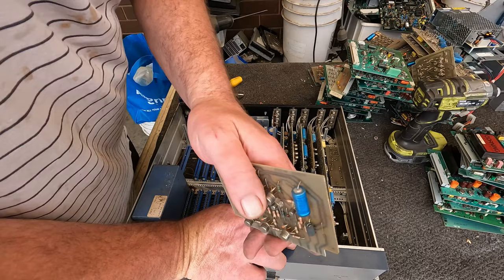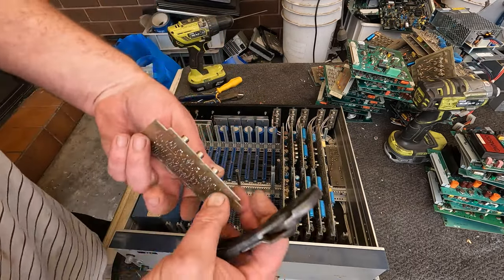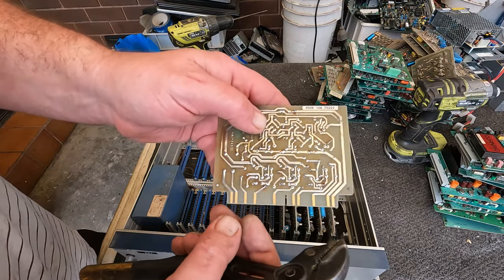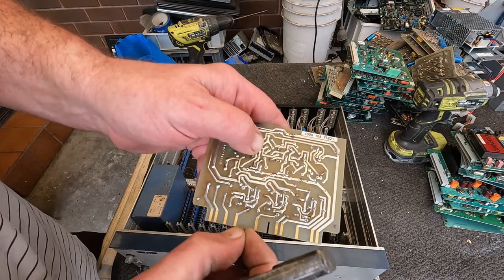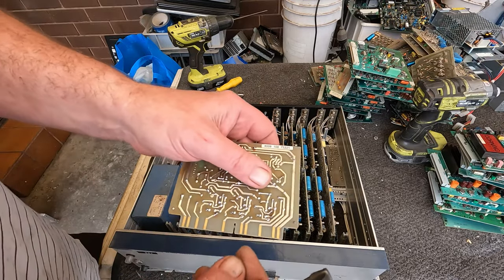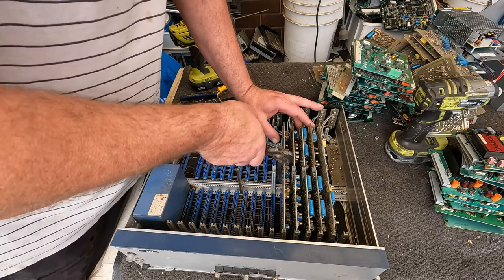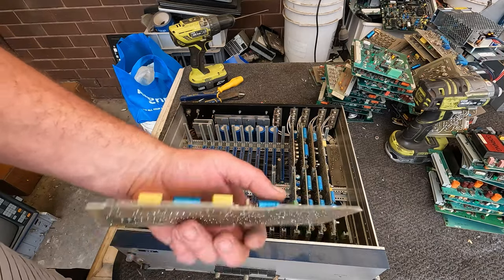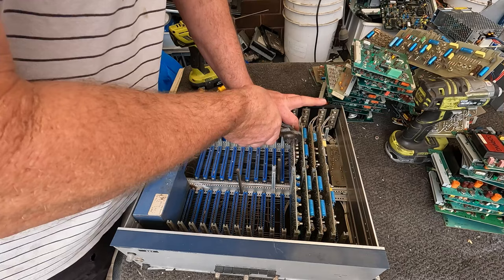These are all got gold legs, so they're gonna be the good ones for gold recovery as well as silver recovery. If they don't have visible gold, it's most likely just silver recovery. And the fingers - if I was to break these fingers off, I don't keep the whole fingerboard like that. I kind of cut in between and get rid of the blank bits, especially with these because they're only one-sided anyway. Just in case I end up selling my gold fingers - so people know they're gonna get good stuff and not a whole heap of blank rubbish.